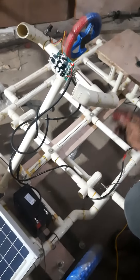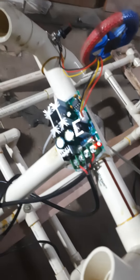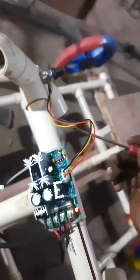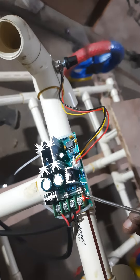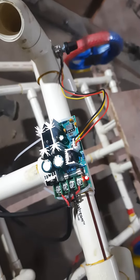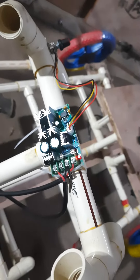This fully charged battery is going to give input power supply to the linear circuit board, which consists of driver ICs. Whenever a variable resistor provides an input voltage to the circuit, there will be a linear waveform which is going to rotate the motors gradually, meaning the voltage will be coming up gradually.